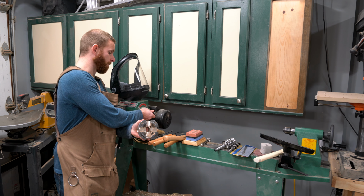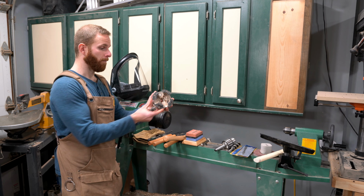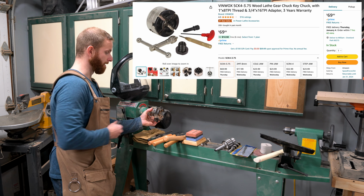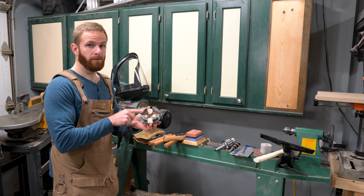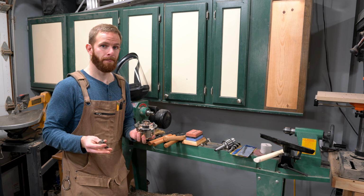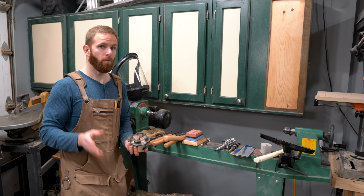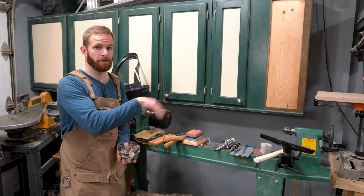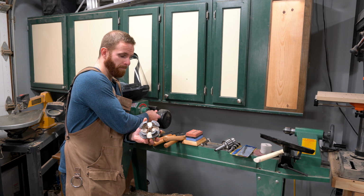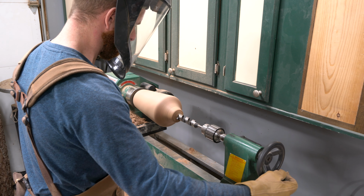And so that is going to replace the spindle with the teeth, and then we'll be mounting the four-jaw chuck right there. And so the reason why we need the four-jaw chuck is because without it, we can't drill a hole. Because if we have the wood in between the two spindles, there's no way to release that side to drill a hole because it's not secured on any point. It'd just fall over. So once we put that new bottom and mount it on the four jaw chuck and mount it on our lathe, now we can remove the other end and then instead actually drill a hole.